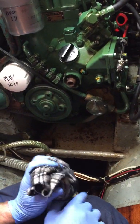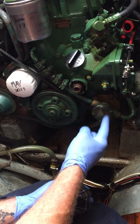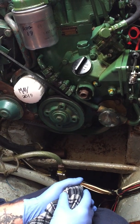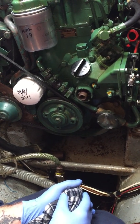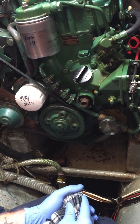Whereas if it's just a lip seal, nine times out of ten you can get lucky by pulling the face plate off, the impeller out, and actually replacing the sealing situation. So you don't need to start stripping pumps and putting them in presses. Again, if it's not broken, if it's not leaking, then leave it alone.